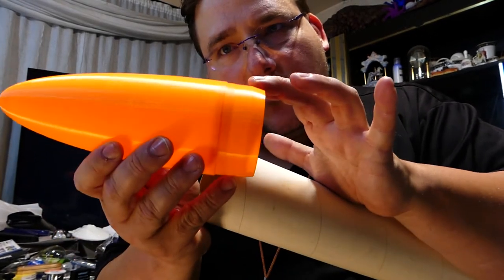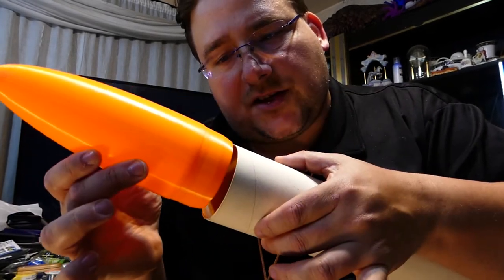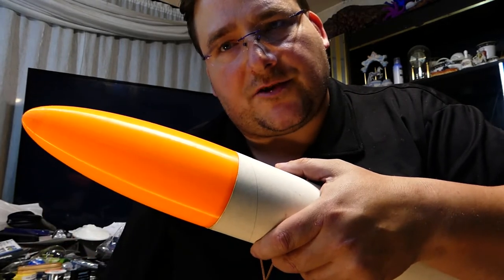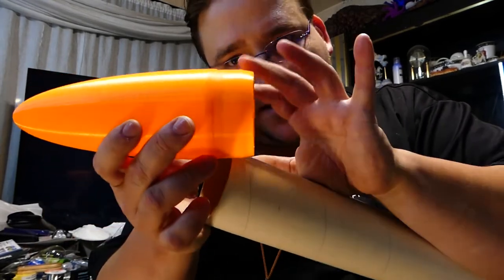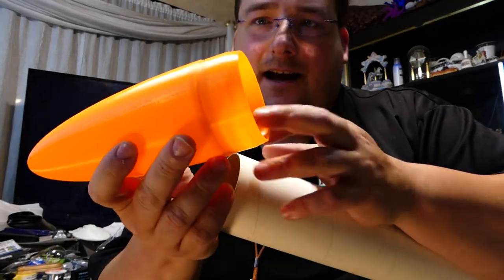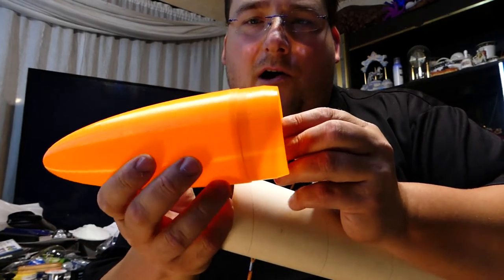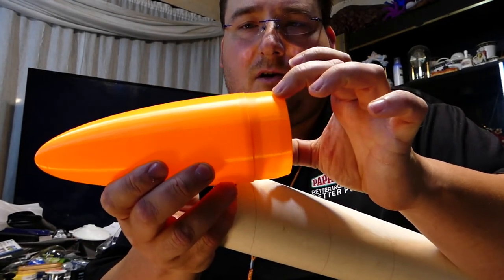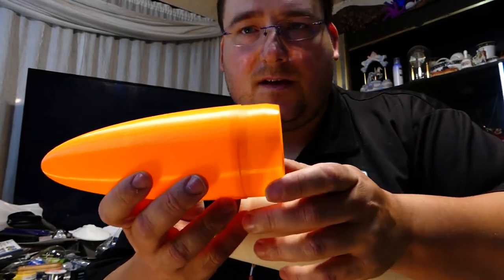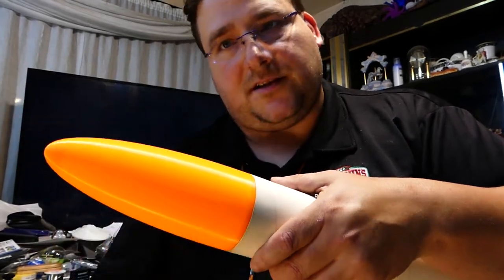And then that smooth curved edge going from the chamfer to the proper diameter just pushes the tube evenly and cleanly out of the way, and you get a perfect insertion. So that is cool. That's something that's difficult to do in a manufacturing process. As a matter of fact, I believe that's damn near impossible to do. Not impossible, but hard, because you're making the part smaller. I don't know how that would work, but they usually don't do that. It's usually just a curved edge. And in 3D printing, I can do that, and it just inserts so perfectly.